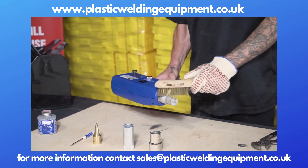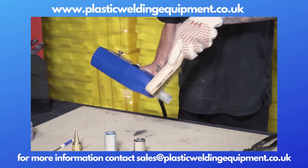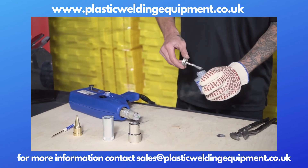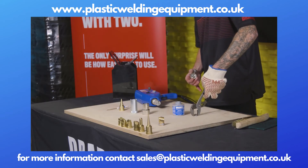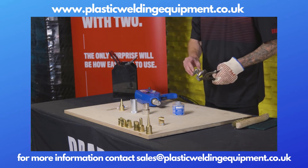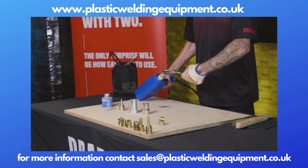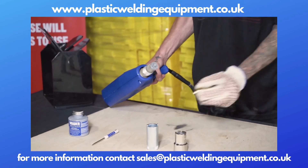As we're doing this tip change, we're using a brass brush or equivalent to remove any residue, making sure we get a good bond when we start applying the heat transfer paste. It's very important that this heat transfer paste gets applied each time we do a tip change. We're going to put this on the heated barrel washer on both sides. The heat transfer paste allows for lubrication and excellent heat transfer from the barrel to the welding tip.